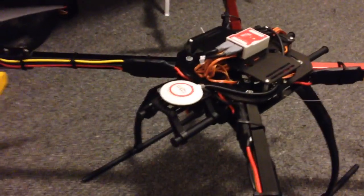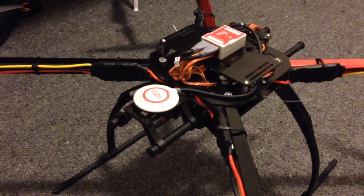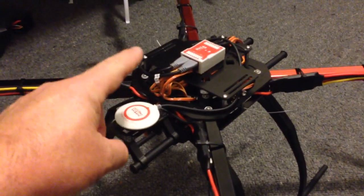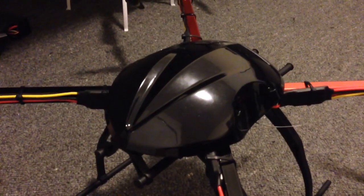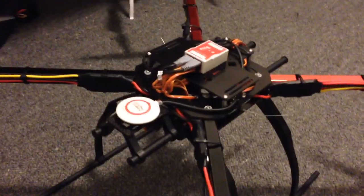The only concern is it's fairly closely located to two ESCs — that could be an issue but I won't know until I fly. If it doesn't work out I'll resort to using the pole, mounting the antenna higher and feeding it up through the back of the canopy. I prefer not to, but I'll try it in this position first — if it works fine I'll leave it, if not I'll use the mount. Thanks for watching.